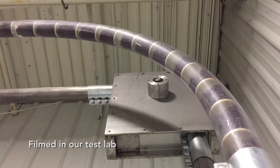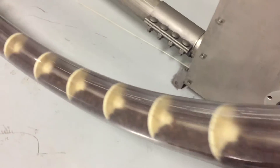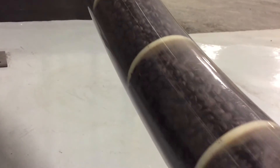What we have here is our cable flow conveyor. This is a tubular drag conveyor that utilizes a braided stainless steel cable with UHMW discs molded onto the cable at intervals, in order to create pockets where the material will fall in and be gently conveyed throughout the process.